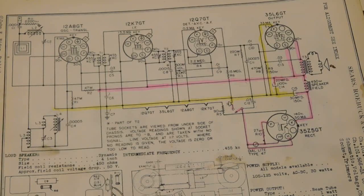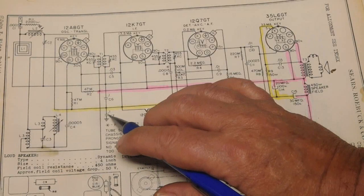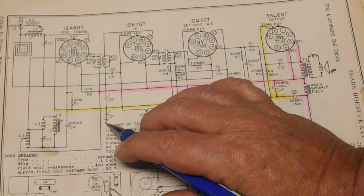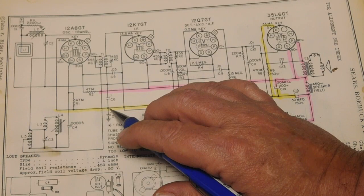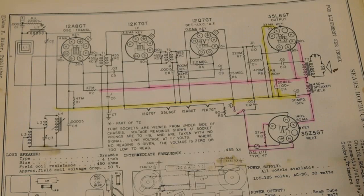And they do that in various ways, there are a couple, three different types. This particular radio has a capacitor here that's attaching to B minus. They're going to couple it always to the B minus, or circuit ground. This goes between that circuit ground and the chassis. That way, any of that signal will flow back through that capacitor. Mostly what we're looking at is AC signal anyway. And then we return back on the return path, or the B minus. In a lot of cases, they may put a resistor in there as well.